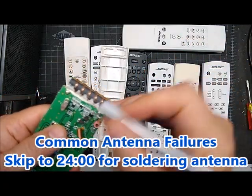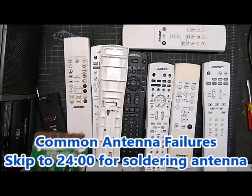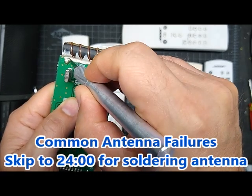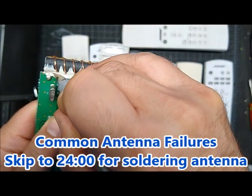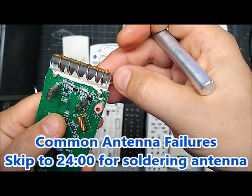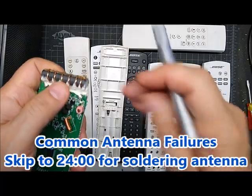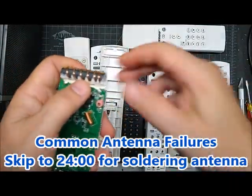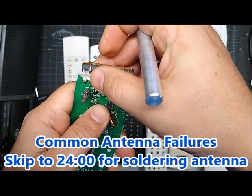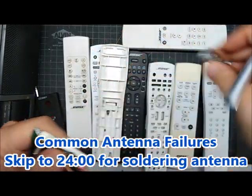The easiest thing to do is to just take the antenna off. You need a soldering iron for this. I'll go in with an X-Acto knife — there's a wire right there and a wire right there. I'll slide it across. Look at that — it was broken because it just went right through the wire. So this board had a broken battery contact and a broken antenna. I'm going to trim off the wire over the glue — it's very floppy, almost broken through on that side too.